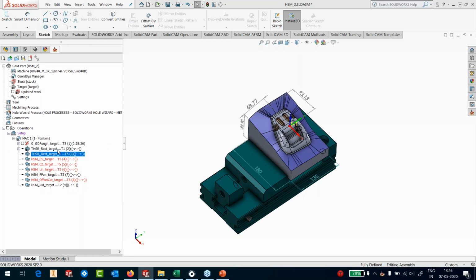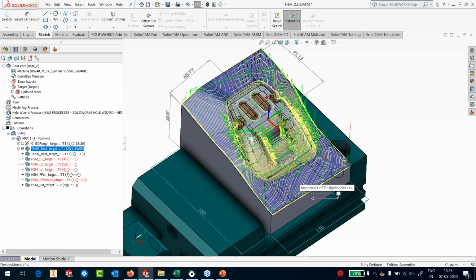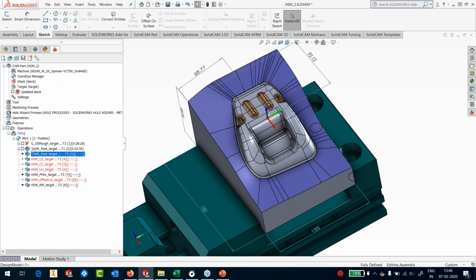Once this operation has been calculated, what I will do is I will finish the parting surfaces because they are anyway almost nicely tangential, so I'll not have much material there. I don't unnecessarily need to spend a lot of time doing my work. You can see already in the background, the calculation was done. Okay, so now I will go here and add an HSS operation.